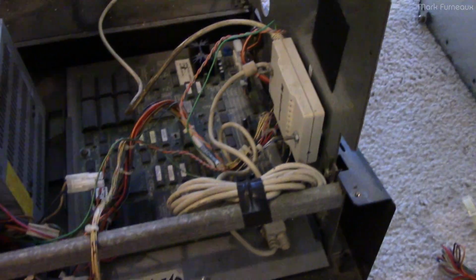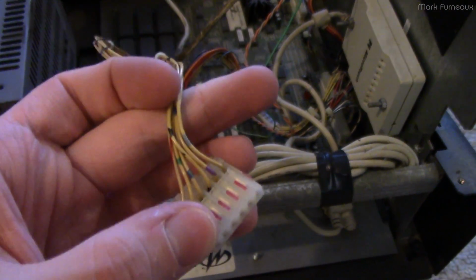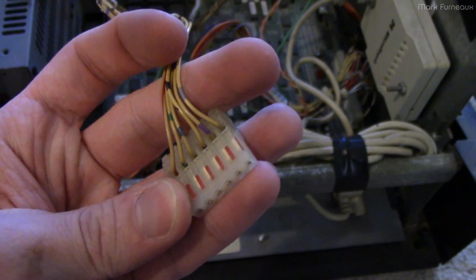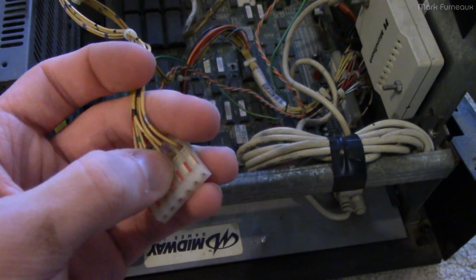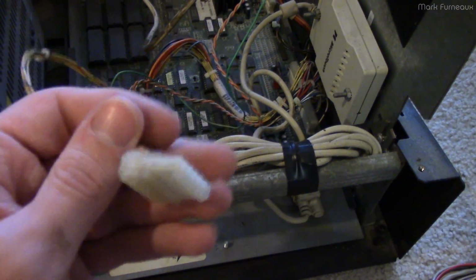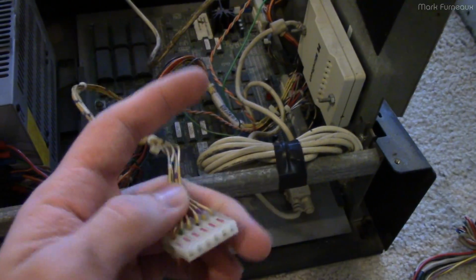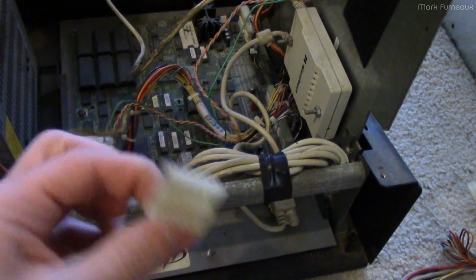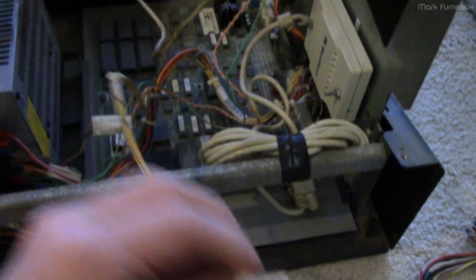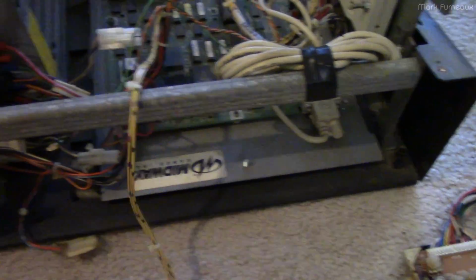This stuff works fine. If I disconnect the CRT, so this is the connection to the CRT, this is the video connection, and so there are 6 lines here. So I suspect it's probably RGB, horizontal or vertical sync, and ground. That would be my best guess. So in that case, you could probably convert this to VGA. You could hack up a VGA cable and basically make this thing have a standard video out. If I want to sacrifice a VGA connector, I might try that. But you could probably get this thing to output to a standard monitor without even trying.